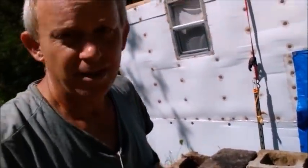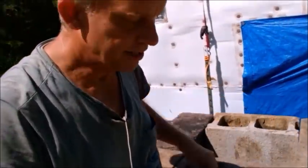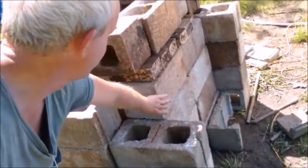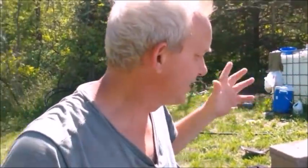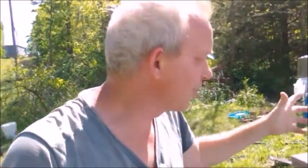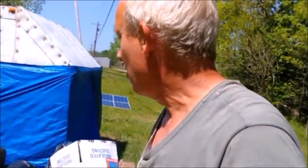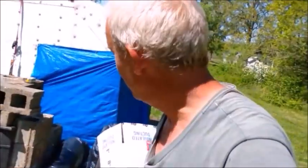I've really closed in the design here. Yesterday the back wall was extended out quite a bit — probably another three or four inches. Since then I pushed it in, because I realized the tighter the spot, the hotter it's going to get inside. And it is really hot. It got so hot that I tried to rearrange the bricks and they were just too hot to touch. We threw some wet logs in there — they're not burning very hot — but the heat being contained with all those blocks is phenomenal. I think we're going to have a lot of success with this.